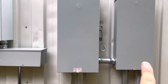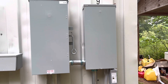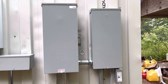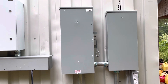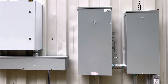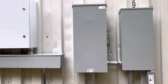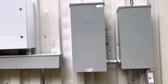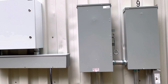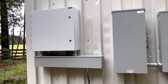This first panel all the way over here is the main panel from the electric utility. From there, it feeds inside the building into the inverter AC input panel. It also feeds over to this manual transfer switch, which allows me to select straight from the grid when it's in the up position, or when it's in the down position like it is now, it's going through my inverters — because all the power for my house and property right now is coming from the inverters.